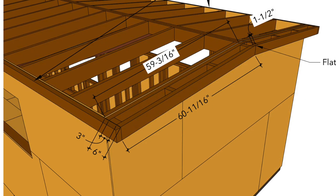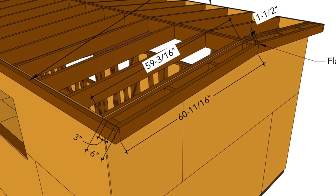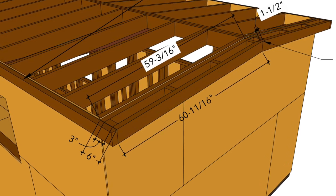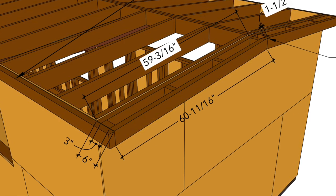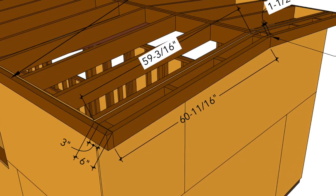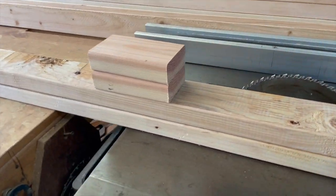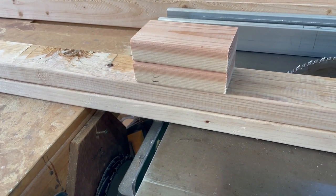So that extra 6 inches in the blueprint was just a tiny little skinny block, like a 2x4 that was say 3 inches. And so Doug was like, instead of just doing that small 2x4, let's create a bulkier thing so we can use nails and hopefully it won't split the pieces in two. So I created 6-inch blocks to go in between the two pieces. Doug tried the framing nail gun and it immediately split into two.